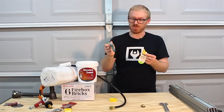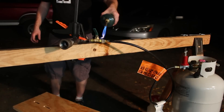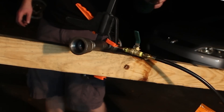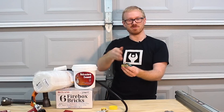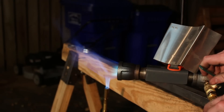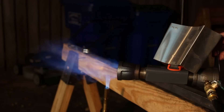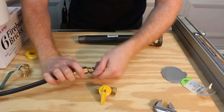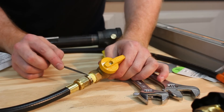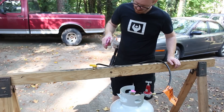There is a difference between a regular ball valve and a gas ball valve. I noticed that as I was checking the fittings with spray bubbles — I also used a small propane torch to light it — and I noticed that there was gas leaking out of the ball valve handle in addition to the spot where I could see the bubbles. I picked up the proper gas ball valve. I believe this flange fitting is leaking, so I'm going to make up this connection first, check it for leaks, and then check the rest of the nozzle assembly.